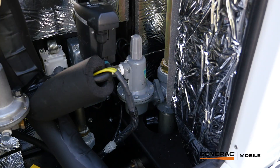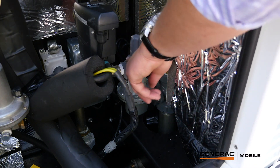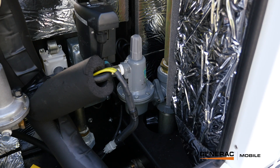If there's a severe over-pressure to the unit, this first knockdown regulator will blow any excess out down the excess blowoff tube and out the back and up top, so you're not blowing off that excess fuel inside the unit but rather outside into the atmosphere.